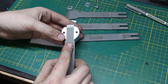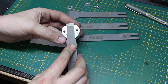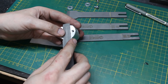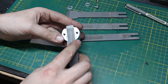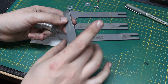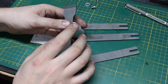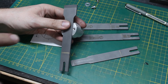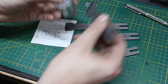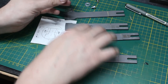Or I can move the blade very far back to grind a 20 millimeter radius for super-fine high-PPI scraping. These slots are cut with a little bit of slop because the bodies of these Biax blades are laser cut and have tolerances, and also some draft. The draft angle from the laser cut means the part is wider at the bottom than on the top where the laser enters the material, so this blade fits only in one orientation. The screws will hold all styles of blades in place.